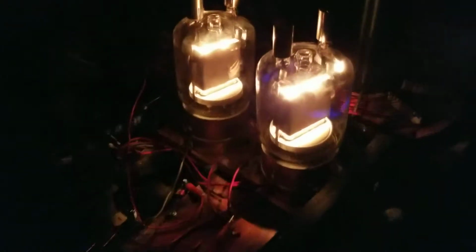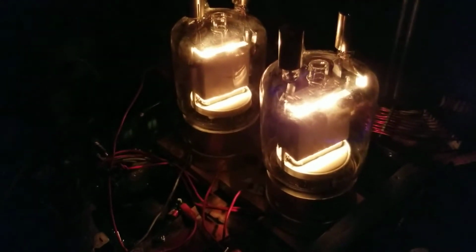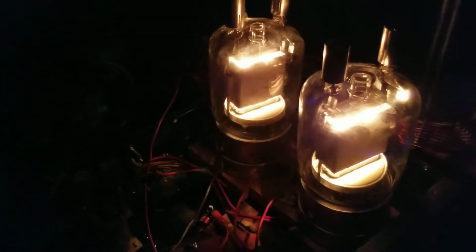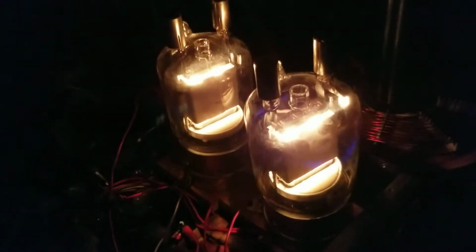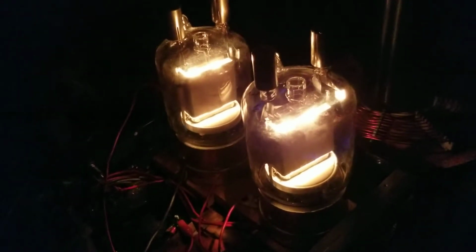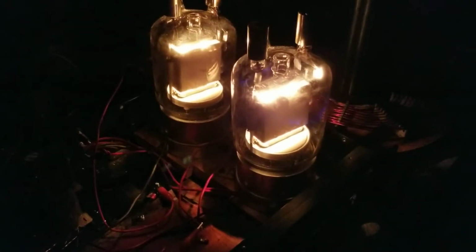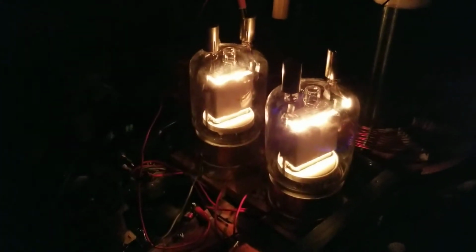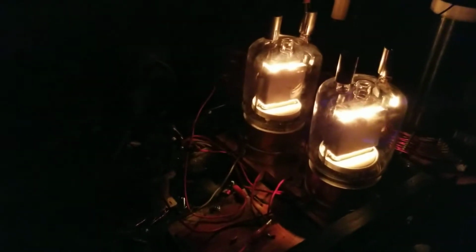So I think it's based off the 60 hertz hum. The mag amp isn't getting 60 hertz in, but the MOT over there, the power supply, has a 60 hertz hum, but it's rectified half wave DC going into the primary up here. So not getting any output yet, but I've just finally got these tubes to actually oscillate without blowing up my preamp tube, which kept overheating on me because I had to drive it with so much gain to get that transformer to work. But for some reason now it's operating much more efficiently.